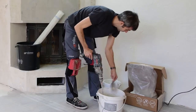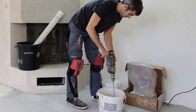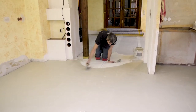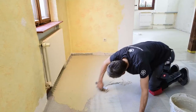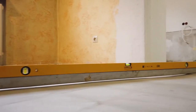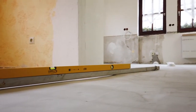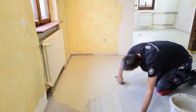With a stable dry mortar, a basic filling is produced. Mix the powder with so much water that a consistency similar to applesauce is created. Then the material must be lightly rubbed into the reinforcement fabric to level the joint grid. Proceed in partial areas — always mix new material and work wet in wet.